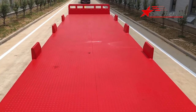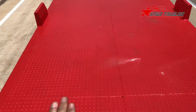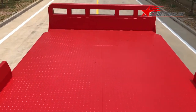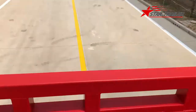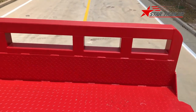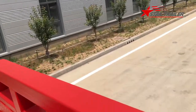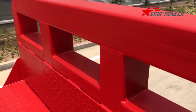Now we are on top of the trailer. You can see more clearly from the top. The reason the floor is very flat is because we use robot welding — it welds automatically, better than a human hand. We put a plate at the bottom to prevent leakage to the outside, but in the top we leave it open. We use square tubes like this, and we always drill two holes here — you can see when I go to the bottom.